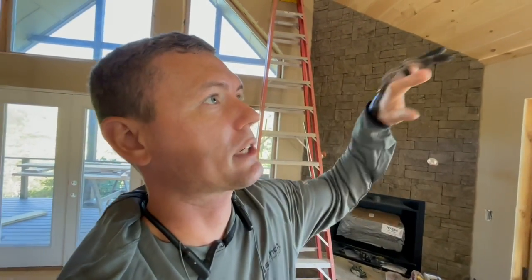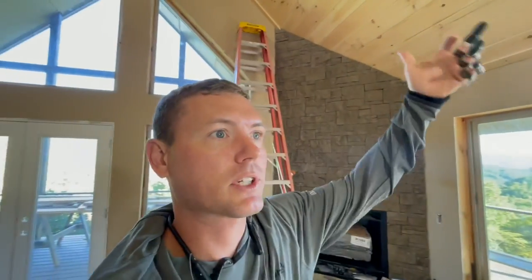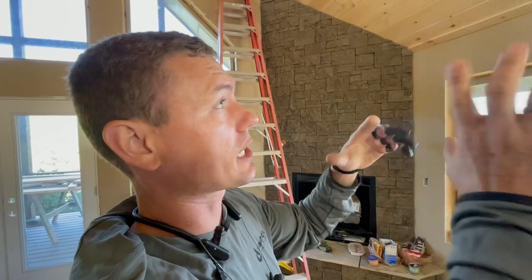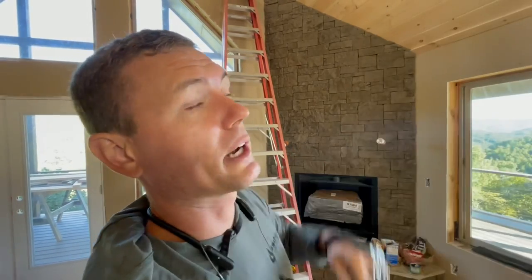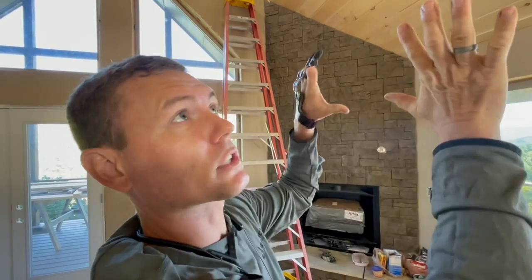The struggle factor is more if you put it the other way. The flat part of the board can bow in and out, conform, and you can nail it and beat it tight. Whereas if you turn it on edge, it can't come forward. It also makes the trim look more like part of the ceiling rather than something added to accent it — it's not a crown molding, its only purpose is to cover the edges where we left it about a quarter inch short on purpose, and to cover the nailing around the edges.